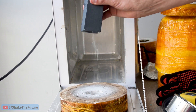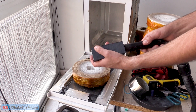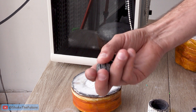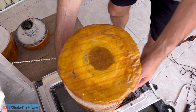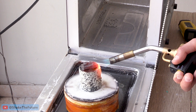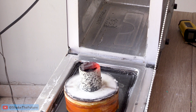The mold has been burned out, now I need to get rid of the ashes. I'm gonna melt 222 grams of cast iron — it's a broken 1kg weight plate. But before that, I decided to heat up the mold nice and hot. To speed up the melting process, I preheated the crucible with a blowtorch before putting it in the microwave.